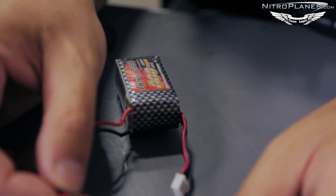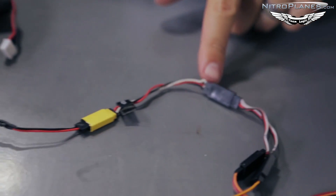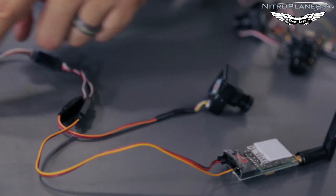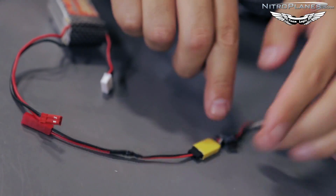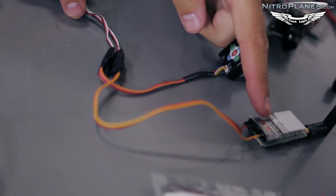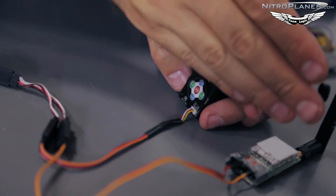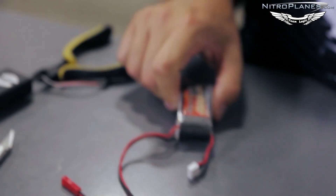When I apply power, if you follow the loop, the black wire goes all the way through to the ground of the camera and the ground of the transmitter. The red connects back to the power of my lead. The white wire in this setup is not used. Another thing to note: make sure the power of your camera is also compatible with the power of your video transmitter. In my case these are both 12 volts, so running off a 3S LiPo should be no problem.